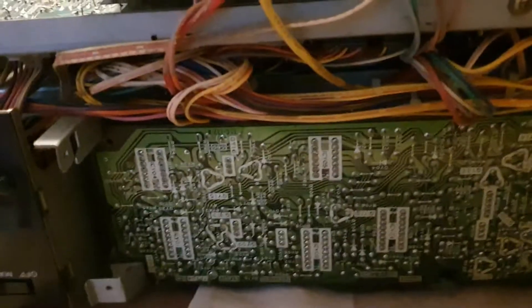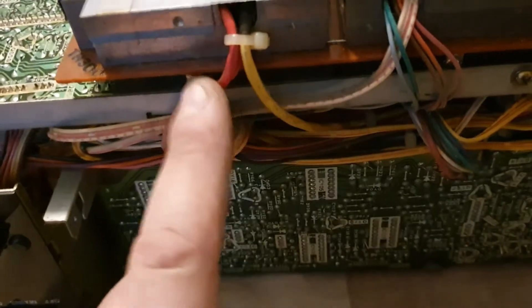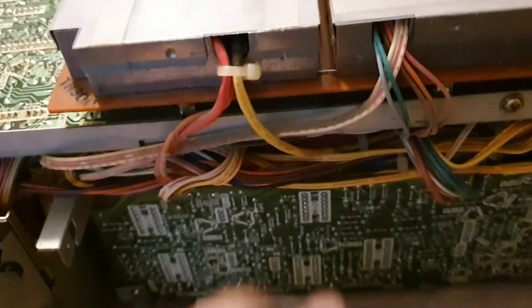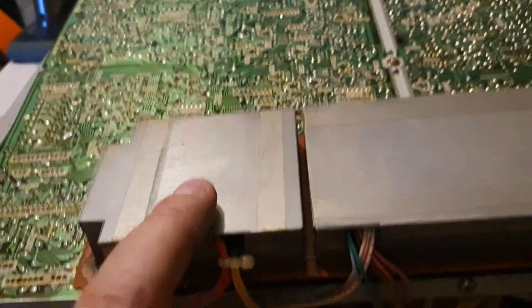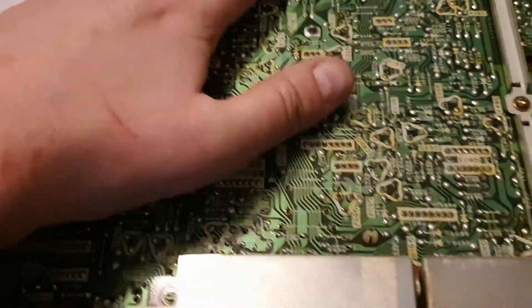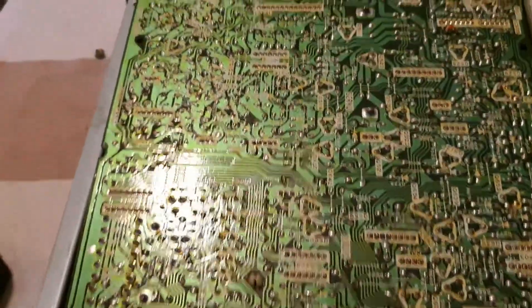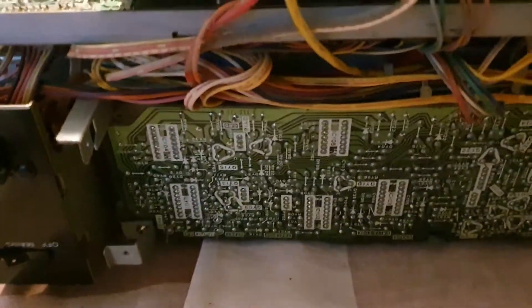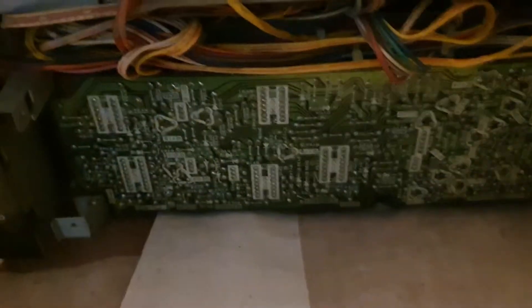So I'm in the process of stripping this down and the setup is actually quite fascinating. Because this has four heads, you've got what I think are two heads — it could be a head each — so four heads going into the head amplifier board here. Then you've got four going on to the servo board, which is dedicated to capstan and servo head switch points. There's an awful lot of cable ties to remove and you've got to thread it through this rat's nest of wiring — I'm trying not to disturb it too much to minimize reassembly.